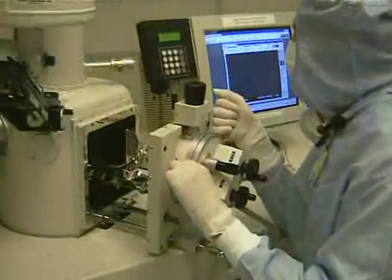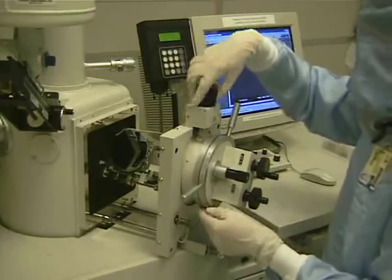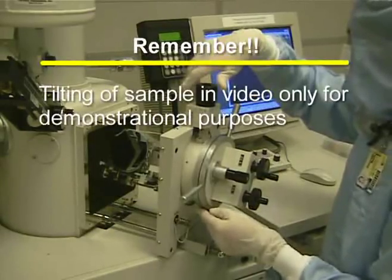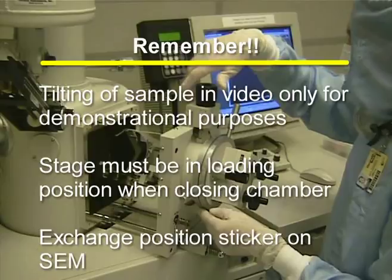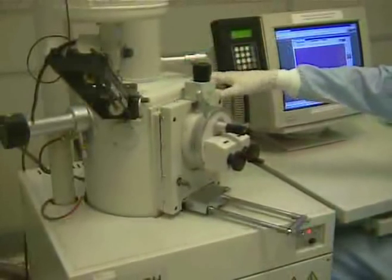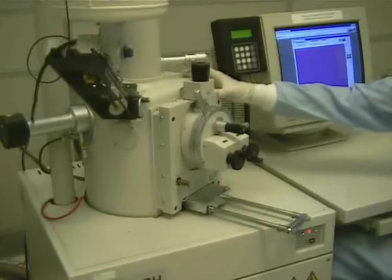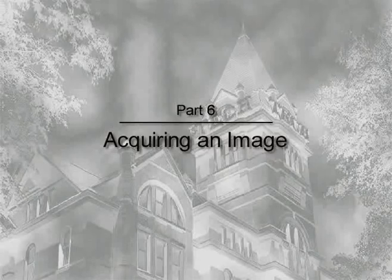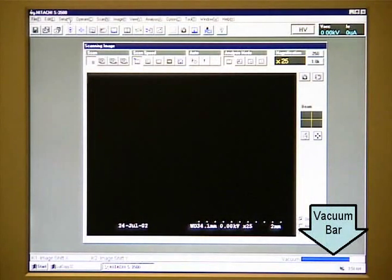Be careful when tilting the stage with a large wafer. Tilting the stage can crash the sample into the lens, so be careful to lower the stage when tilting. The stage must be in the loading position when the chamber door is closed. The exchange position sticker on the right side of the SEM has the venting positions listed on it. After loading a sample, push and hold the chamber door closed and press the Evac On button. When the vacuum pump starts, let go of the door. Wait for the chamber to reach operating pressure — the vacuum bar turns blue and the text box states the high voltage is ready.